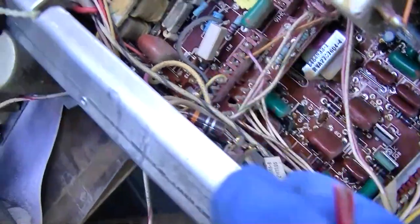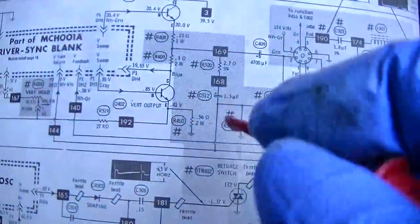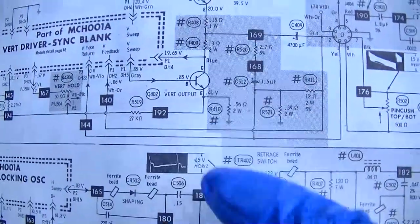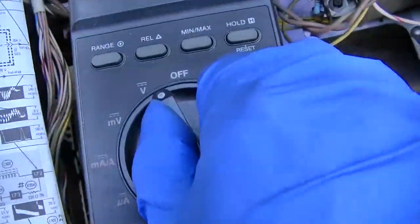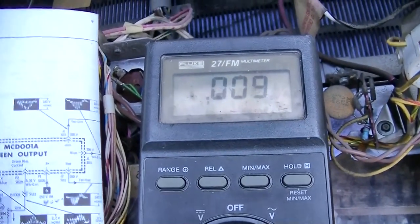This transistor is flipped — they're flipped over from each other. The 0.3 ohm resistor is on this guy here. The emitter is reading 0.01 volts; it should be 0.4 volts. Well, of course — the transistors are not conducting. The base is 0.5 volts; it should be 0.85 volts. I wonder if there's any AC here — doesn't look like it.